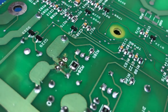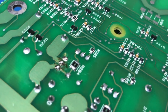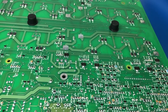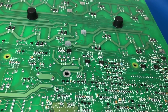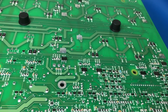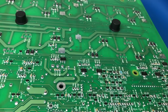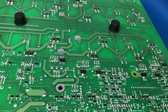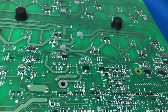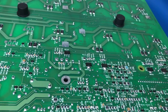It's okay. No matter. Alrighty. So what this means is that theoretically, we have replaced, well, definitely, we've replaced the broken parts that we know about. So I'm not going to dive in and do the smoke test on this just yet. Now that I've got those parts in, I just want to do some more poking around with the meter, some DC resistance checks. Theoretically, both channels should test more or less the same in terms of DC resistance, so I can just do some sanity checks. I'm going to spend some time doing that. I also need to clean up the chassis before this board can go back in, because we've got our mud hornets colony to clean up. But let's have a close look at this board first.